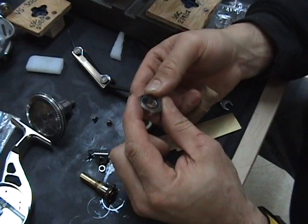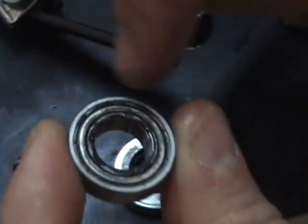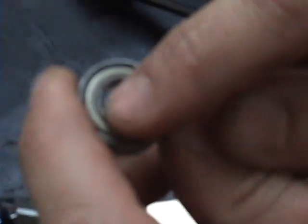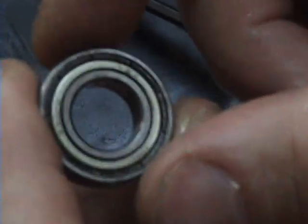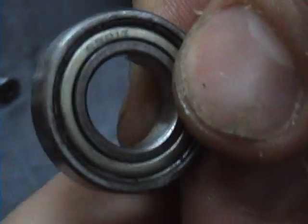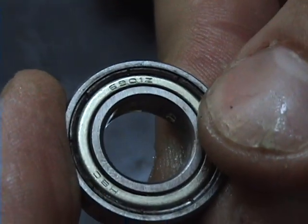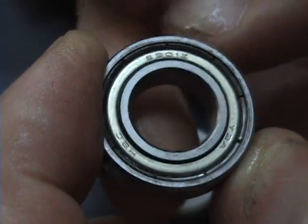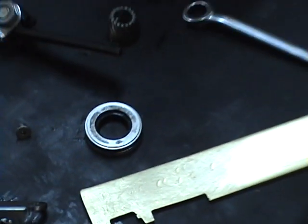You can see this one isn't stainless steel — you can see the rust and corrosion on it, as well as on a few others. If you look closely on the gear, you can see the other side and actually see the bearing part number. It's 6901Z, which is an encased bearing. If it were a stainless bearing, there'd be an S in front of the six. And there we go — that's the part. Thanks for coming in.